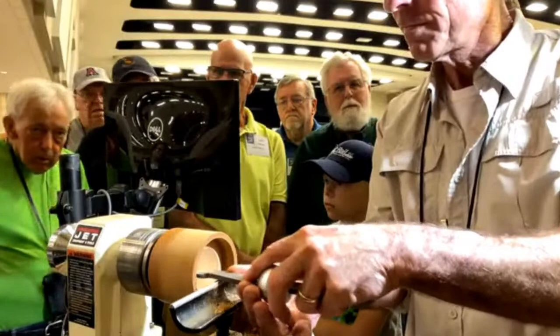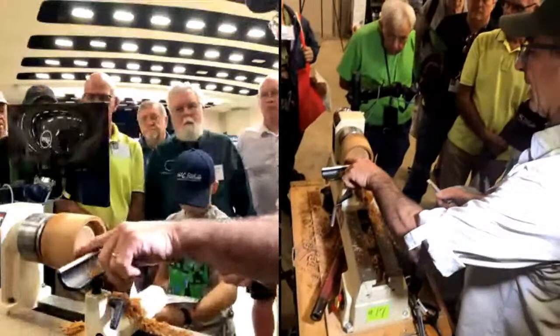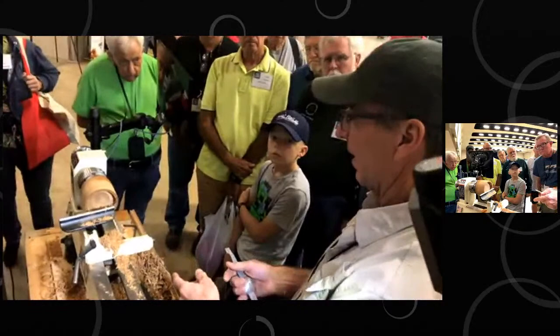And you're done when everything's perpendicular to the bedways and the interior of the threads, or the top part of the thread, looks just like the thread chaser itself, a pointed piece of wood or spiral. That's a good thread there. Now, if I had the wood, I would fit a male to go to there. That's as easy as it is.